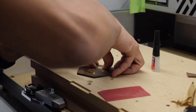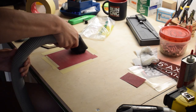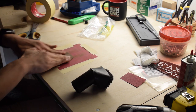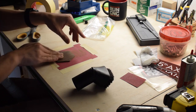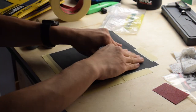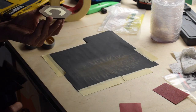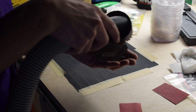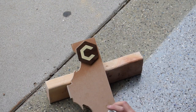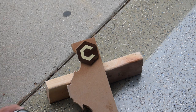I glued the brass into the walnut and started sanding. I wanted the inlay to sit dead flush and seamlessly with the wood. Unfortunately, my inlay was ever so slightly proud of the face of the walnut, and metal is a lot harder to sand away than wood. But with so much invested emotionally, I wasn't about to cut corners on the home stretch. As I brought my brass flush with the surface of the walnut, I stepped up to 1000 grit. To remove contamination from the wood grain, I vacuumed the face of the insert — pro tip: use a natural bristled brush attachment so you don't accidentally scratch the surface with synthetic bristles. Finally, I coated the entire thing in spray lacquer for brass, which contains anti-tarnishing additives but works just fine on the walnut too. And that is the inlay piece done.